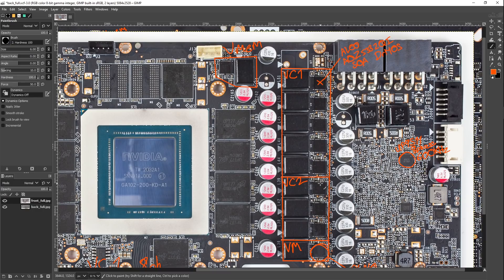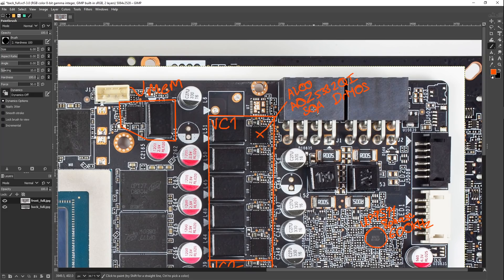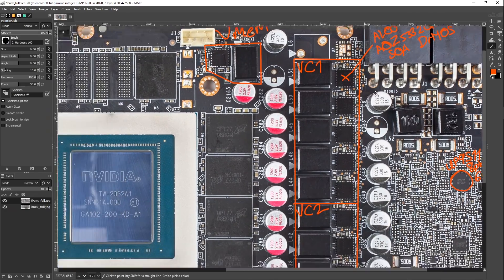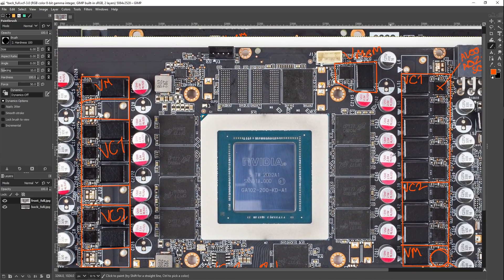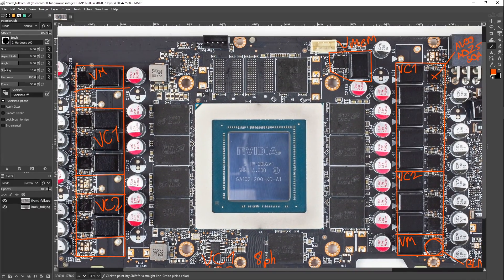The Founders Edition actually uses some very nice smart power stages — I'll be doing the PCB breakdown of the Founders Edition for Gamers Nexus, so subscribe to them so you don't miss that. These 50-amp DRMOS parts are common on all 3080s I've seen that aren't the Founders Edition, but the Zotac Trinity has the least of them — only eight in VCore 1 and five in VCore 2. Three-phase memory power is actually pretty normal; I've seen only one card so far with four-phase memory power.